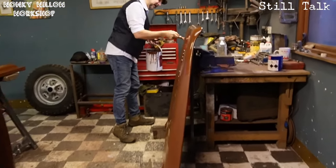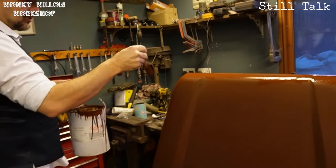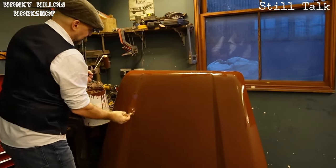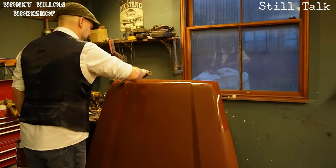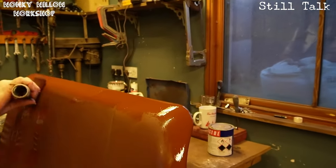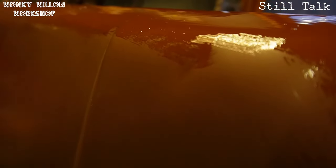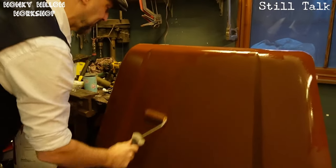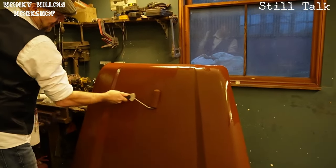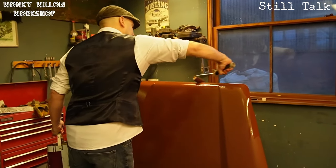You can see there's a wee bit of orange peel just now, but that'll smooth out — it'll lose some of that. The Tractol bubbles — but again, you play with it. If you put it on heavy it'll bubble, but if you put it on at the right depth it doesn't. The right roller and the right paint and it doesn't bubble. Basically if it's bubbling, you've got the wrong paint and the wrong roller. The Tractol bubbles do come out — do a couple of panels, get a bit of faith, find out what it does. The time you go back to them and take it out a little bit thinner, they disappear.